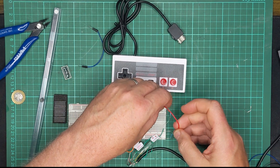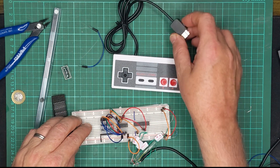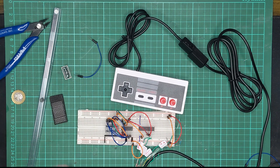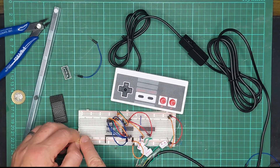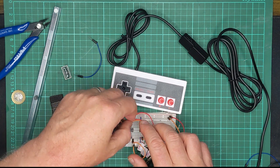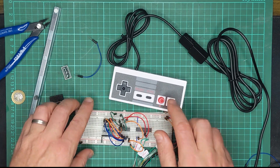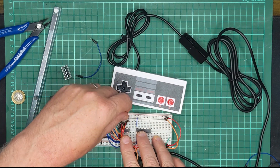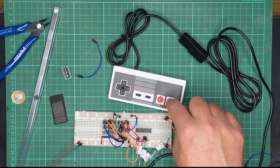I need to bridge power across the two rails. Let's hook the controller up to the cable and give it some juice. Let me eyeball it once to make sure I haven't done anything obviously stupid. Let's pull that output enable low — it's the fourth pin down on the right side here. Nothing happens. I need to pull the clear high — make sure that's not in the clear state. Pulling that reset signal high seems to have cured it.